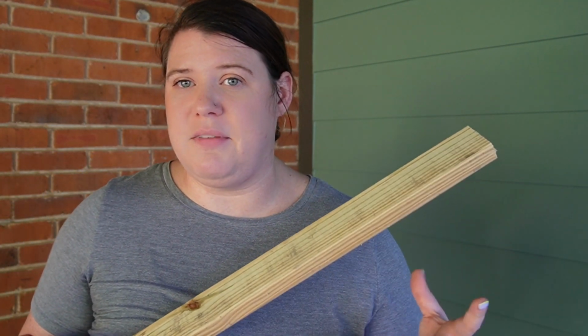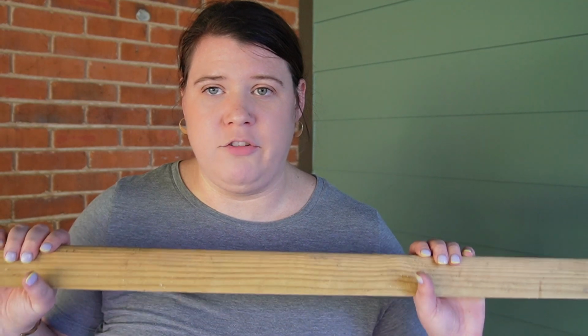They typically say 2 to 3 weeks. A good way to check is to take a screw and try to screw it in, and if any moisture seeps out from that screw or nail head, then it's still too damp. It also tends to have a green cast, and that's the chemical. So anyway, I think we're in good enough shape to start today.